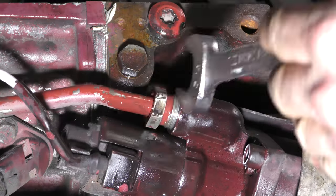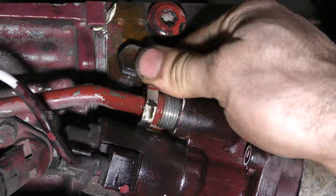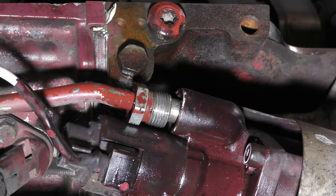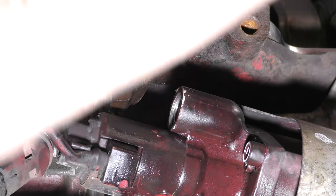This return line is also pretty difficult to remove if you're doing it while in chassis, and a lot of guys including myself will resort to using a shaved-down 3/4 wrench in an effort to gain a little bit of extra space due to the extremely limited access.